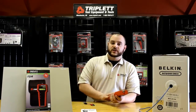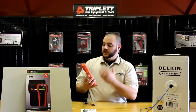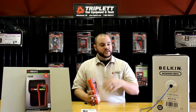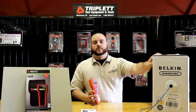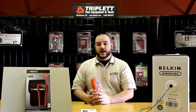Some other nice features: it runs on a simple 9-volt battery and it's a very easy product to use — it's got just three buttons. You choose the cable type, press the button, and it does a quick snapshot. One reason you'd want to test the length of a cable is, for example, checking how much cable you have left in the box when you go to a job site and know you're going to need 500 feet.